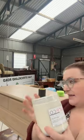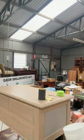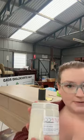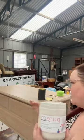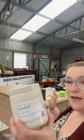We're using Pure Eco Matte Finish. Yesterday I had a couple of 250ml jars and I finished those off — I had just enough to get a coat over the whole piece. This morning I'm opening a new jar. It comes in the 600ml and the 250ml. These jars are the perfect size to fit our sponge applicators in. These are a water-based polyurethane. They are very, very durable. I have it on my own bathroom vanity, and we've been using it for about nine months and it's holding up really, really well.